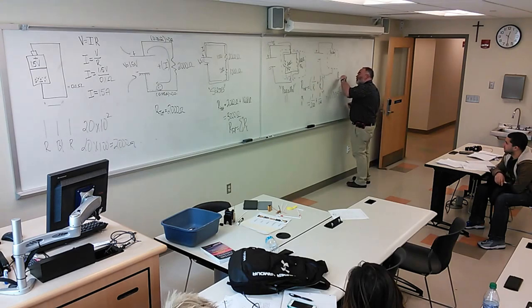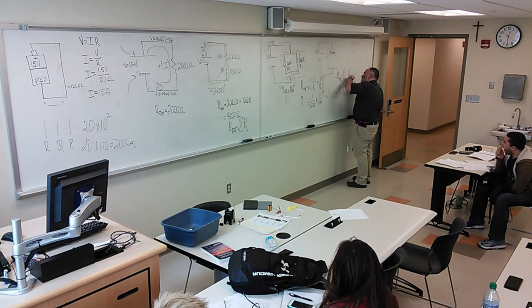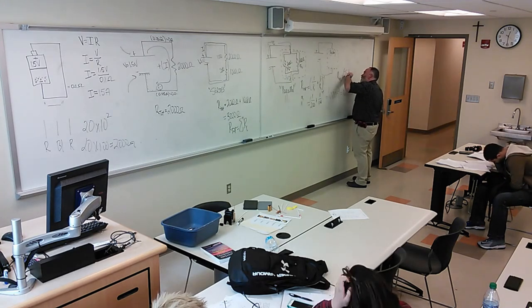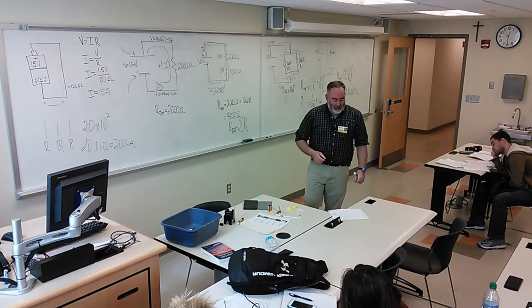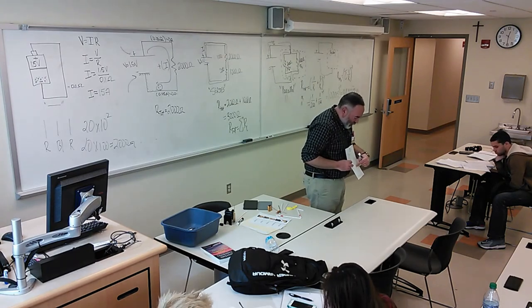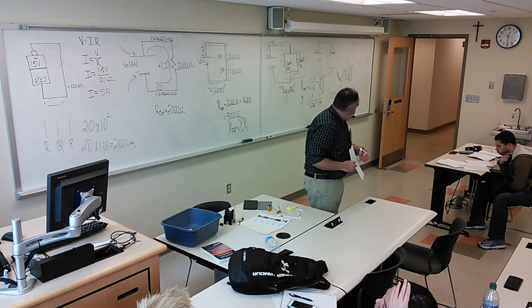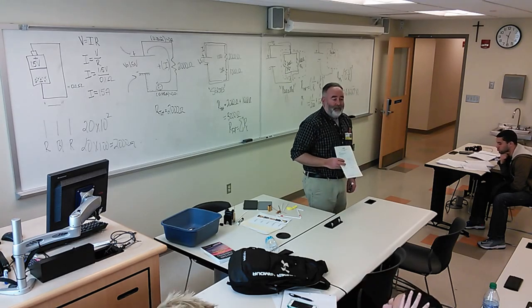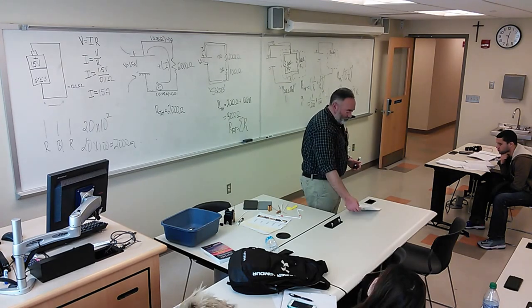The R total for a parallel circuit, or you can call it the equivalent circuit, is simply take all of the resistors and add them up as 1 over, and then when you're done, flip it back over, take the inverse of that guy. So that's this guy. Sum up all the 1 over the 1 overs. And then when you're done, take that total and flip it again, bring it back up. That's just practically how we do that. So when we get in the equation, we can figure that out. Okay.